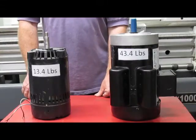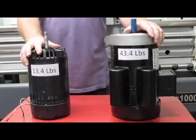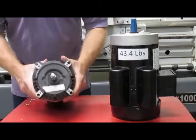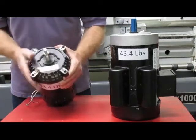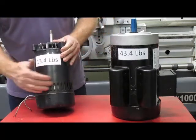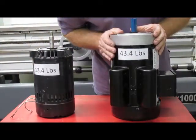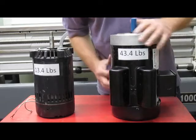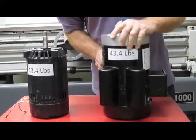We're going to talk about the difference in motors between the US FilterMax motor and the typical motor you'll find on the direct drive. You see these mounted directly to the bottom of the centrifuge. You can see it's open top and bottom for ventilation. The US FilterMax motor is obviously much bigger and it's sealed all the way around, top and bottom — totally enclosed and fan cooled.